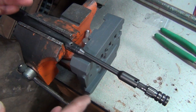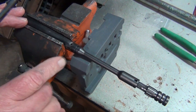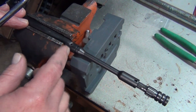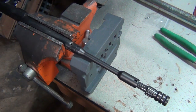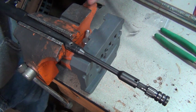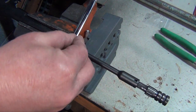That's going to be a matter of choice if you want to go ahead and drive the pin through to where it's even on both sides. Per the instructions, you just need to drive it in so it goes past the outside of the carrier and then set it down to the top of the chamfer and it's in. So again, that's a matter of preference. I always like to use my hemostats to get them started. It just saves on fingertips.